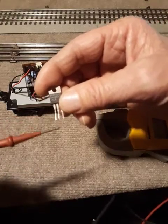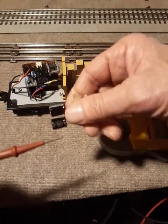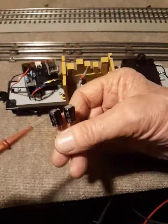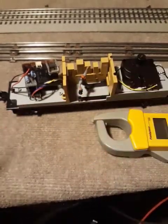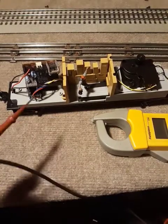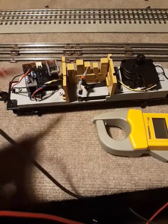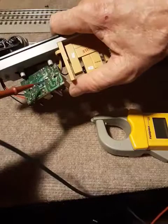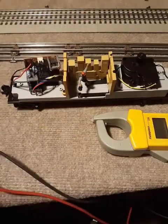Then I started learning about the capacitors on the sound board. Sometimes the capacitors would look like a piece of popcorn — the top wouldn't be flat anymore, it would be all bubbled out. So I would replace those, then learn more about the cascading effect: sometimes just because a capacitor goes out and you replace it doesn't mean that other things went out, like the resistor or diodes.